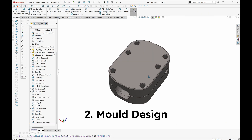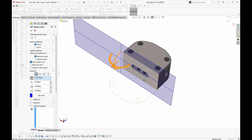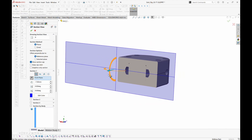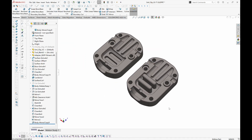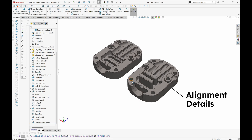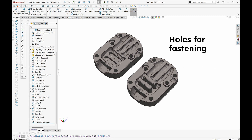Once you have the part you want to create, you need to create a mould — again in 3D CAD software. A mould is usually two or more parts with a central cavity, which is the negative of the part you want to create, so you can inject plastic into it and mould the part. Some of the features and considerations for mould design are: alignment details to ensure the parts of the mould align correctly; fitment tolerancing, allowing small clearances between mould parts so that the mould is closed fully but snugly; venting, both to let air escape as plastic is injected and as a visual indicator of when the mould is full; and fastening — it's important that the mould can be held tightly shut while plastic is injected into it under pressure.